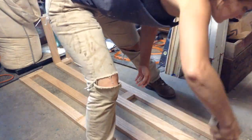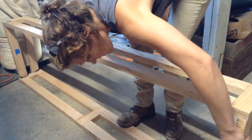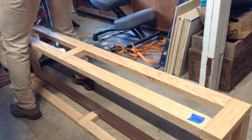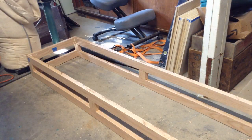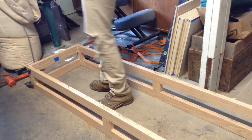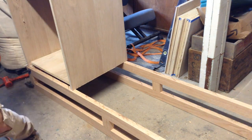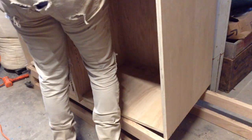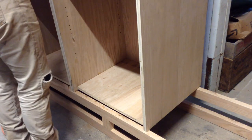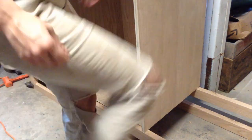Glue-ups are always a little bit of a puzzle, especially getting everything aligned, but this went together fairly easily. I could prop it on the ground, which is actually pretty square — the floor in this garage is pretty flat, which is nice. Once this is clamped together I could still work on the top. I thought about putting some pieces in between in the center, but honestly it didn't really need it. I could put some screws to the bottom of these cabinets into the front and back of this frame and that will sure up the whole thing quite well. You can see how those cabinets will fit in the front — this is before I started the veneering.